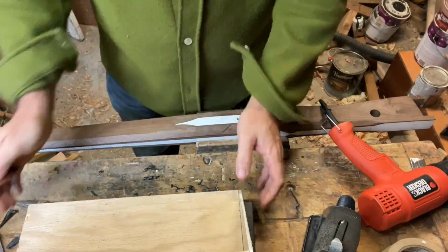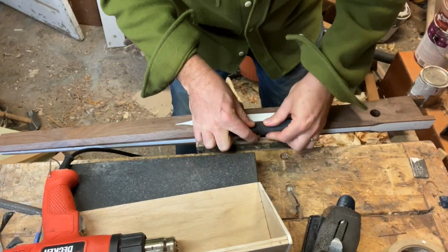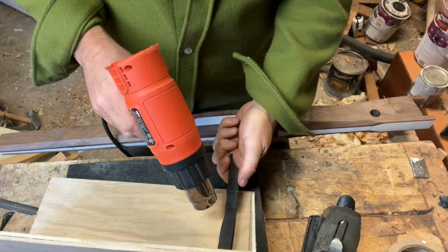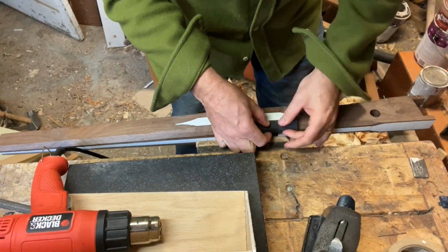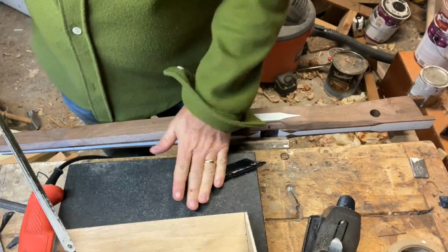And as you can see now, I've essentially started with a brand new inlay piece, and so essentially I'm fitting the inlay piece to the area that I've carved out, rather than the usual process of finalizing the shape of the inlay piece first and then carving out around it. For this shape, and because of that curvature, I find that carving the space first and fitting the inlay piece to that worked a lot better.